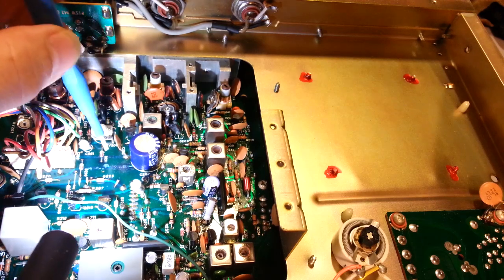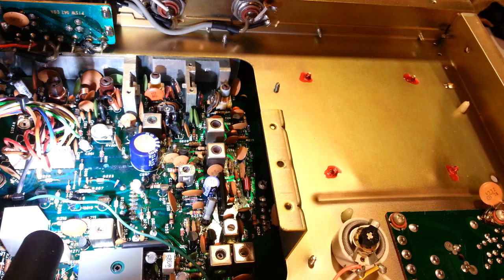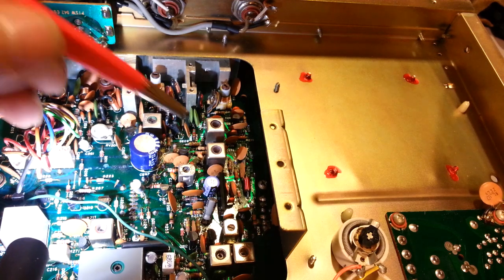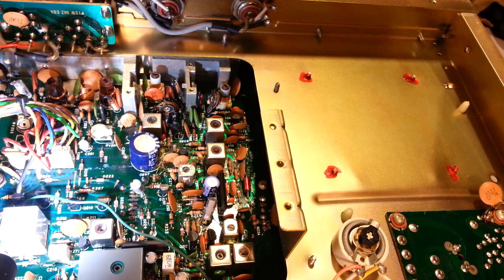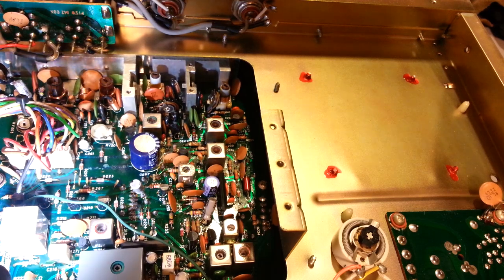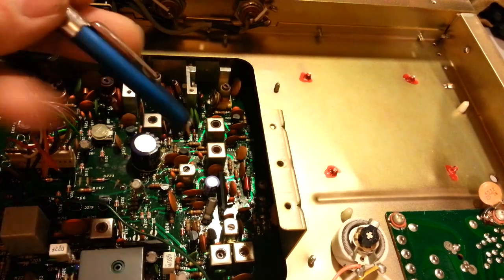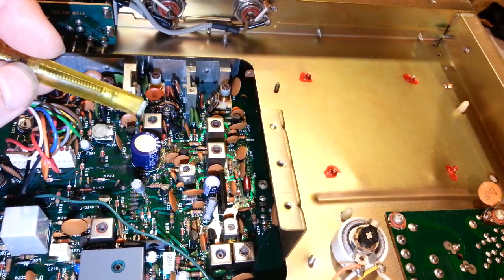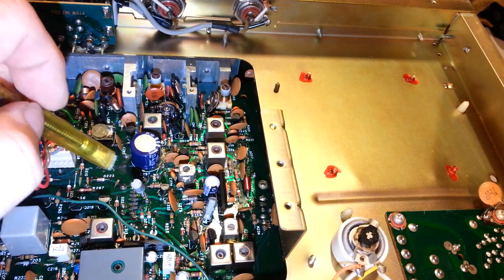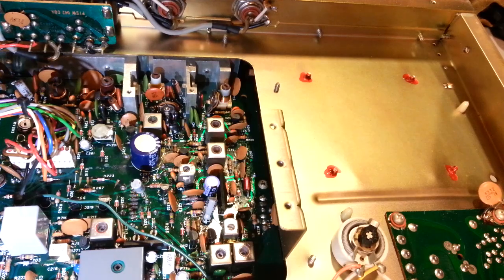It does transmit and receive, so none of the traces are completely corroded in half yet. Usually all you have to do is take the cap out. That's where you see me often using fiberglass brushes like this. You have to be careful when using this brush because if you scrape for too long, you'll rub the trace right off of the board. But that's good for getting the overcoat off and the corrosion. We'll keep fingers crossed we won't actually have to replace any traces.